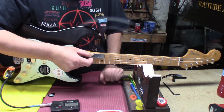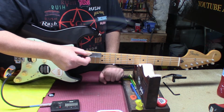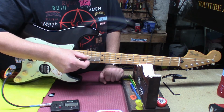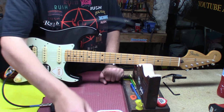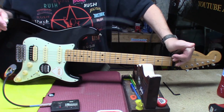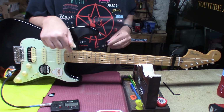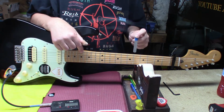And let's see here, where are we at? Between 4.5, at 4.5, 64. Between 4 and 5. Closer to 4. Right at 4. And let's check our relief. I think last night it was around 9 thou, meaning the 10 thou just barely fit underneath that. Let's see where we're at now.